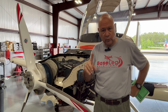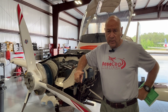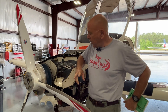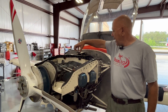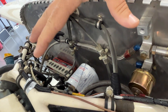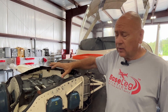One of the magnetos is an impulse coupled magneto. Since we have two magnetos, you have to have one impulse coupled one. The impulse coupling works below 500 RPM — that helps with starting. For those of you who leave your airplane sitting or don't fly it very often: the worst thing you can do is run the engine briefly on the ground. Don't go out to the hangar and start it for 10 minutes once a month. What happens is you're putting a lot of moisture into the crankcase. Combustion water is a byproduct of the combustion process, and in the accessory case — where the magnetos, tach drive, fuel pump, and oil filter are — a lot of moisture gets in. Unless you run the engine enough, which is usually about 30 minutes at a good operating temperature of around 180 degrees oil temp, you're just going to leave a bunch of moisture in that crankcase.